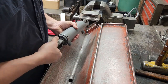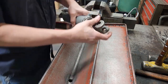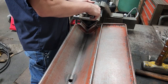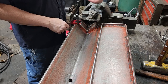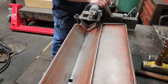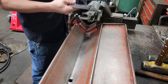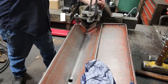For starters, I'll make sure it's empty — it is empty of oil. This actually has a retainer ring in the gland here; it needs turned out by these spanner holes. We'll get it in the vise. The end of the retainer ring is facing this direction, so we're going to have to turn it counterclockwise as if it was threaded. I've got a Proto spanner wrench, number C483 — not sponsored — and I'm going to put this in and try to turn it.